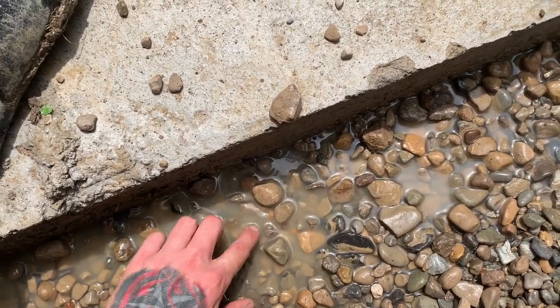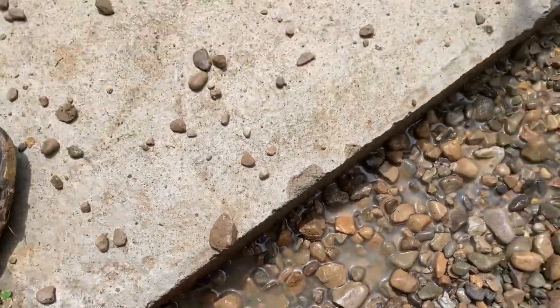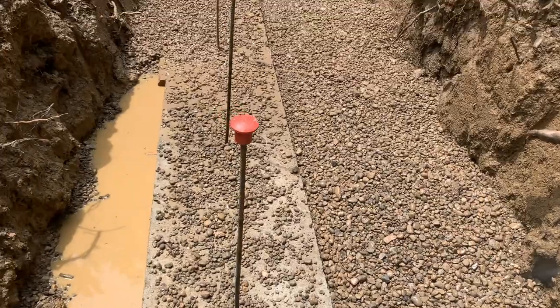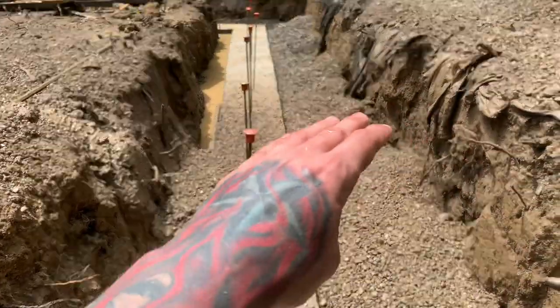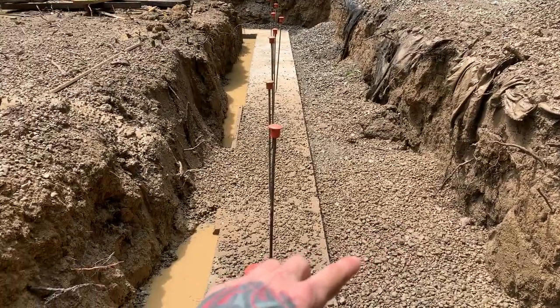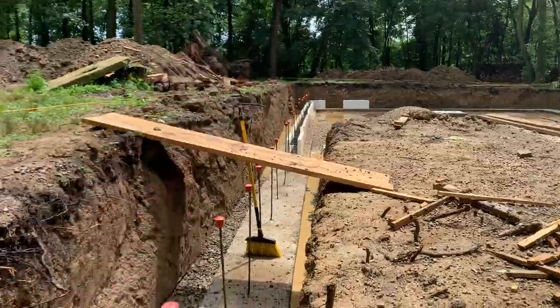This water already goes down a few inches in some spots — you can see that it's actually clear. So this 57 round is excellent for drainage. It'll let all the water go from up here on topsoil, go on down, get into the French drain, and we're going to take it all the way to that back corner right there.